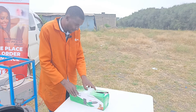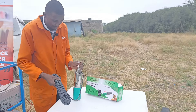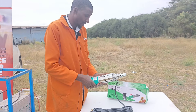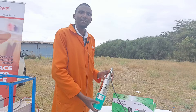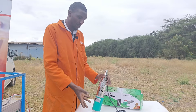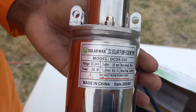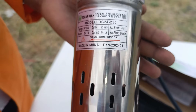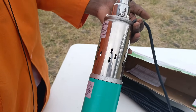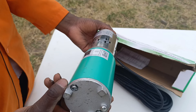This is a submersible solar pump from Solarmax, but I believe all DC submersible pumps will act kind of the same way. Let me read some of the specs: it's 24 volts, 250 watts, the current is 8 amps, the outlet is 25mm — about three-quarter inch — and it has a maximum head of 50 meters.